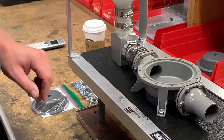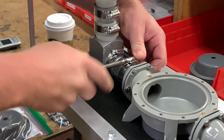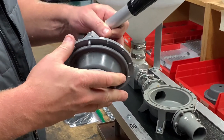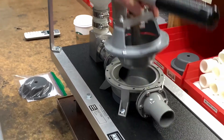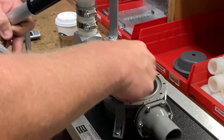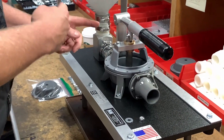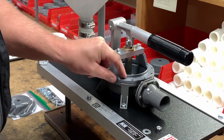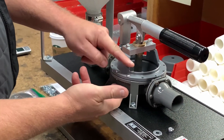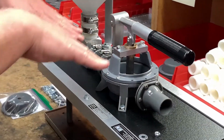After you've tightened all your cap screws down, come back over to the clamp and use your nut driver to tighten that up — just nice and snug, don't over-tighten. Then take your top pump body — the diaphragm which we replaced earlier — make sure that goes on top. On the diaphragm there's a gasket bead rim that needs to sit inside the trough. Handle faces out — you cannot do it the wrong way because the handle won't reach and will hit the hopper. Sit that down, take your 10 slot-headed screws, put them in, then put your nuts back on using a crisscross tightening pattern.